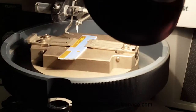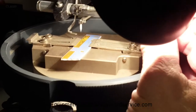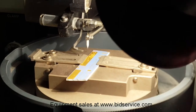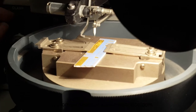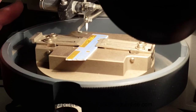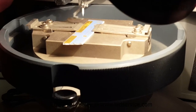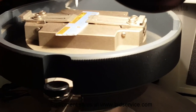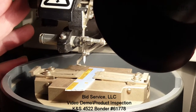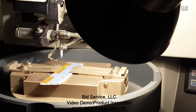There's another way to create a ball if you have a problem. We'll feed some wire down like that — we have a little tail left. I'll close the clamps, and I can push the EFO wand over by pushing on the solenoid up here. Then I can hit the manual spark, and you can see a spark — a ball is created.